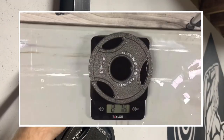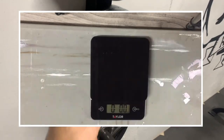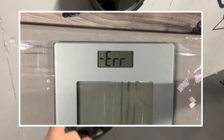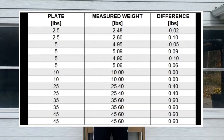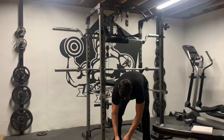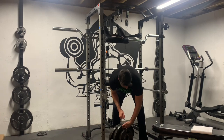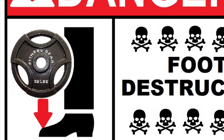I will also point out that these weight plates are not certified calibrated. I weighed each plate in a previous video, and they were all within 0.6 pounds of nominal, but they were all weighed with a bathroom scale, so who knows? Regardless of the small discrepancies, this inexpensive little scale surprised me. It's accurate through the whole range, and it handled the 110 pound load as advertised, but it made me nervous. I certainly would not stand under it.